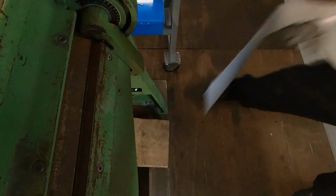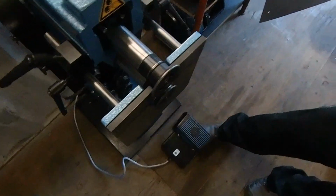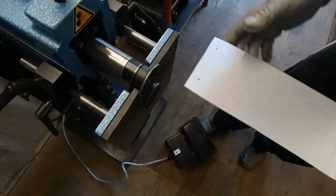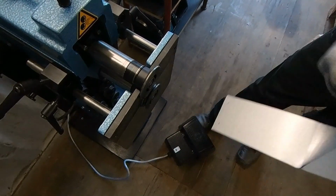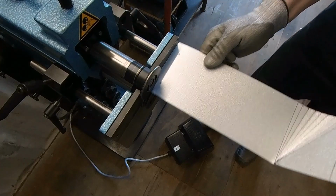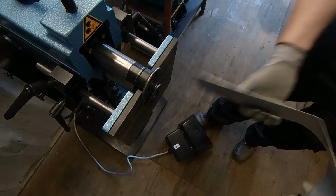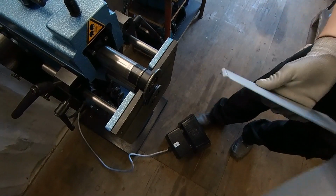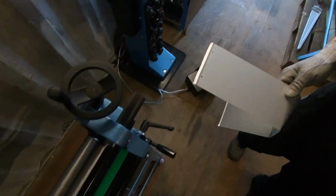So now we're going to put here a swage and we do the rest on the rounding machine. Therefore we go here, on the rounding machine. You can do both sides, doesn't matter. I always do both sides so the fitter can decide which swage he needs from the side of the seam. And now we're going to the rounding machine.